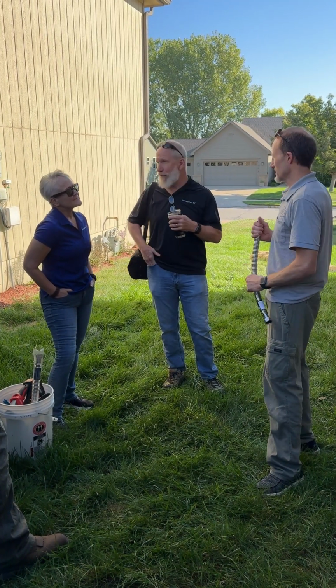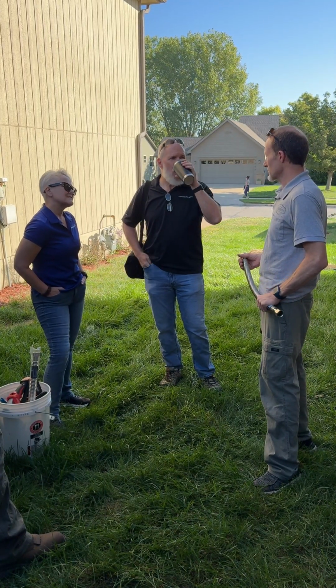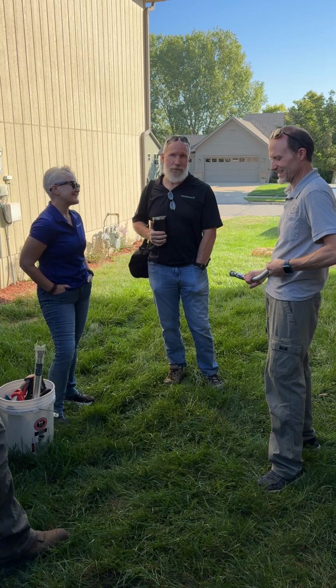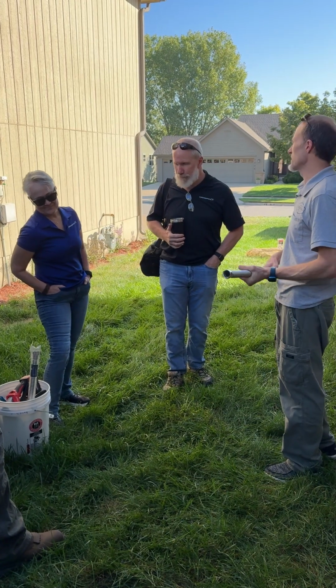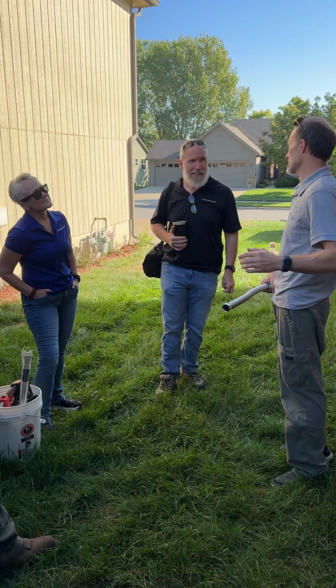We're only gonna be running like a gallon and a half to 2 gallons a minute, so we're not gonna have cavitation. Oh, that's no problem. I was trying to do like 6 or 7 through a hose bib and trying to feed 2 sprinkler heads. Yeah, we're not doing that here. I think we'll be okay. And if he starts watering trees with it, it won't be for long because it's only 50 gallons.